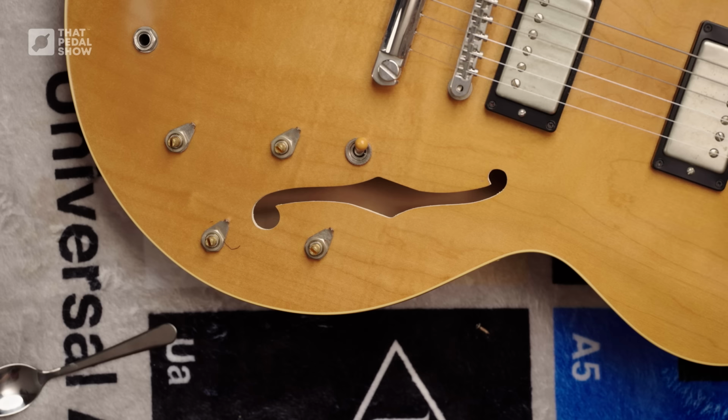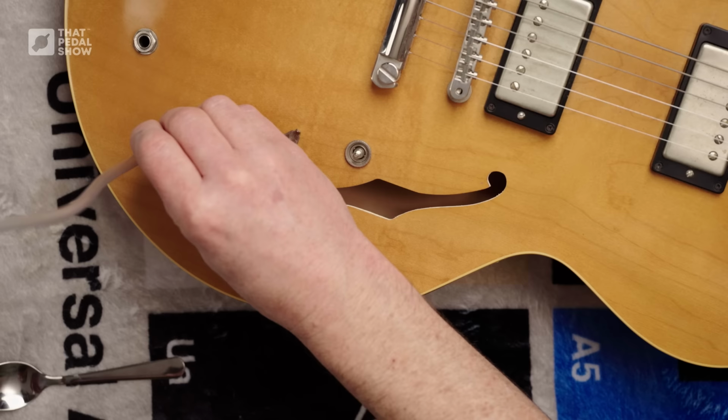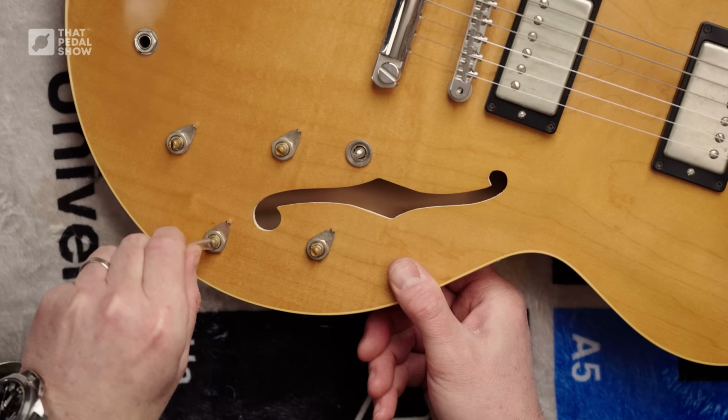Right, screws, pickguard. On a 335, relocating the pots isn't that much hassle, because you can kind of reach that one, you can reach the switch. Yeah, actually it is a hassle. So I learned this from TV Jones when we did the Gretsch Electromatic pickup refit. And you can buy this aquarium tubing stuff. I got this from maybe B&Q or somewhere like that, like an English hardware store. And it's aquarium tubing and it fits with a brilliant tolerance fit right over the end of the shaft of the pot. There you go.